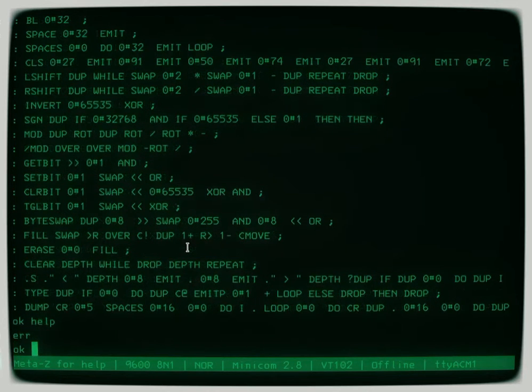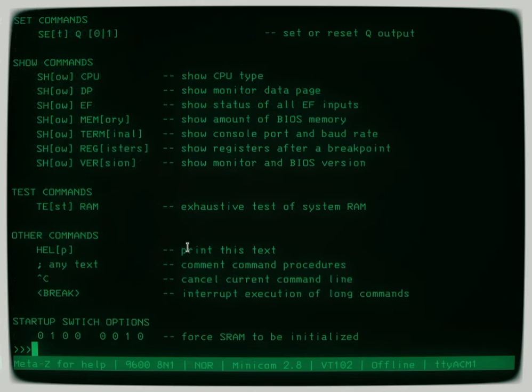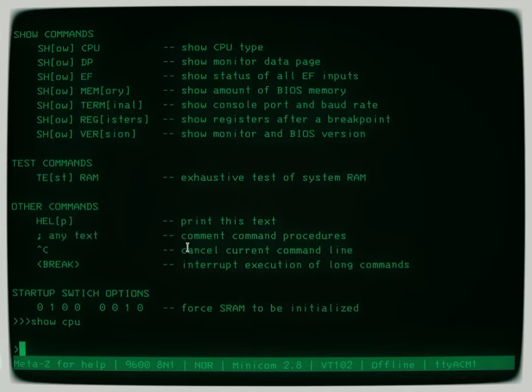There is one interesting little feature here: there's a complete meta monitor, just like in the 1802 Uno, and the only problem is with no front panel anymore, it's hard to get into that. You can turn off the auto boot, and then you've got the serial front panel just like you did before, but it turns out the Spare Time Gizmos ROM, when it detects the type of CPU it has, uses an illegal instruction. And so that's going to trigger a breakpoint into my monitor.